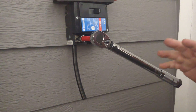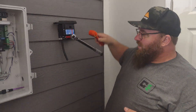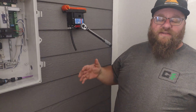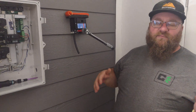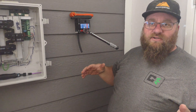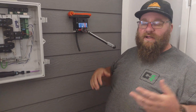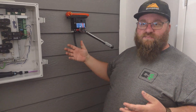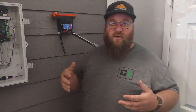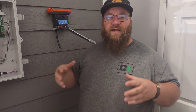These torque specs are based on the wire size you're using. You can actually damage the wire, damage the lug, and the breaker by over-torquing. With under-torquing, things are too loose. You'll see a lot of guys out here with 3-inch wrenches getting as tight as they think they need to. They did a big study and found that after testing a whole bunch of people who said they knew they could get it right, only about 4 or 5% even got it close — and they figured that was basically up to luck. Most people are not able to torque to the standard they need to unless they're doing that same standard every day, and even then you're required to use a torque tool.